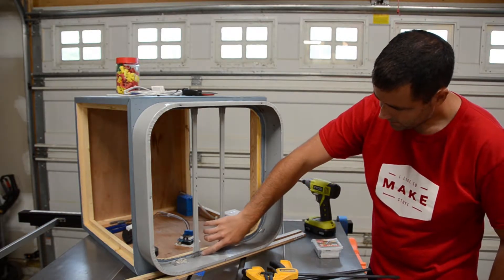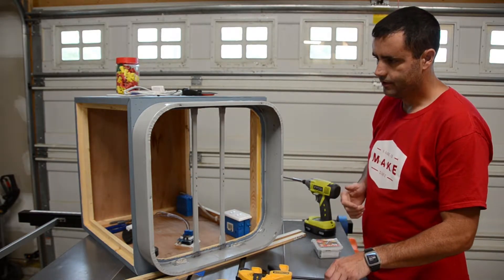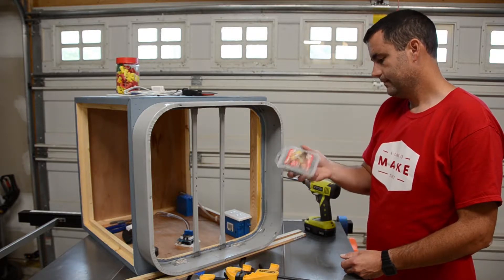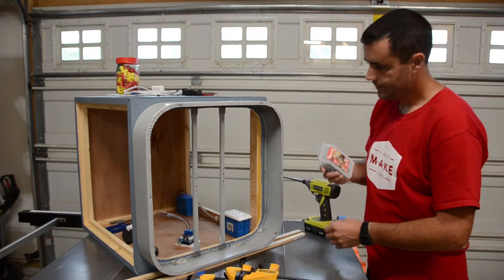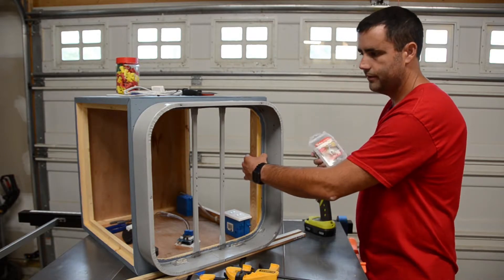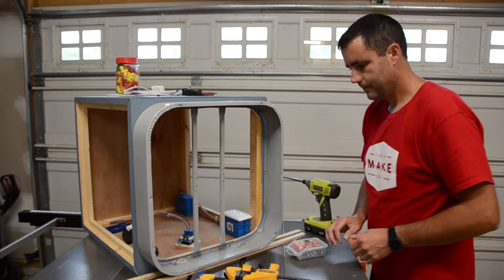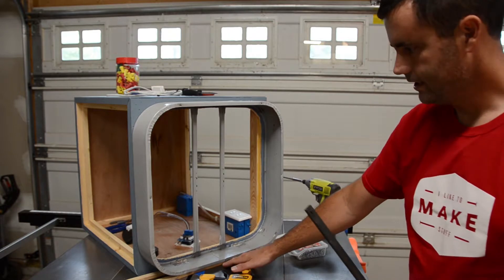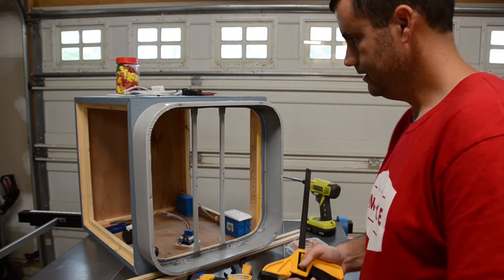There's a very narrow flange around here that was punched with sheet metal screws where the rear grill used to attach, and there's not a lot of material there to run a screw through. What I'm going to use are these lag screws — really just a wood screw with a fairly large washer or flange head on it. If I run this into the wood and capture the flange of the fan with the washer head rather than going right through it, doing that several times around should be plenty to capture it. I'm going to put some clamps on there, lock it in place, and start running the screws in. I've got it spaced up about 3/8 of an inch off the table, and since it's taller than the fan I've got it centered in that space so it looks even.